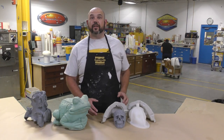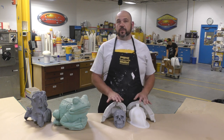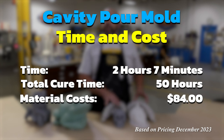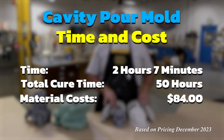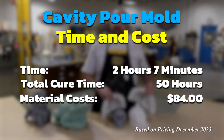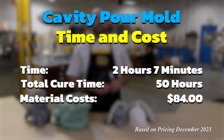All right, let's take a look at our cavity pour mold that we created. Now, this mold here took 52 hours to create. Out of that 52 hours, there was 2 hours that we actually worked on the mold. The rest of the time was spent waiting for the materials to cure. The freeform air that we made the support shell out of is a long curing material. Now, the material cost for this mold was $84.